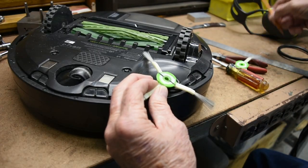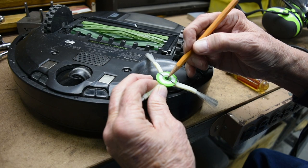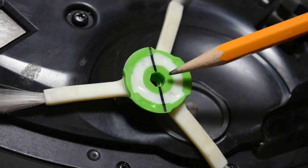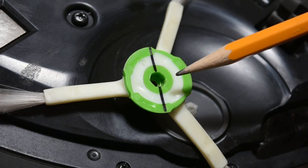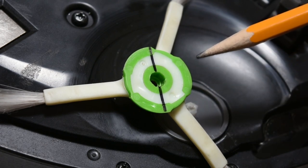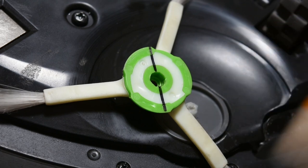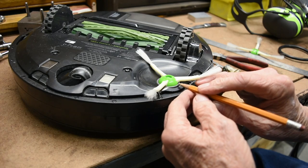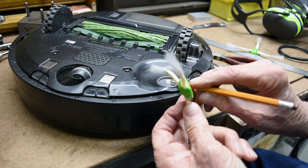What I planned to do was to take a drill and make a hole from one side of the hub, through the center, and out the other side. I drew this line on the bottom of the hub where I could see the six-sided socket, because I needed the line perpendicular to one of the flat surfaces, so that when I later match-drilled this hole in the nylon shaft, that tiny flexible drill bit would also be perpendicular to a flat surface on the shaft and thus not wander.